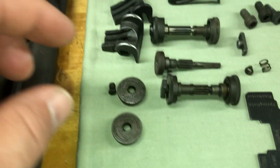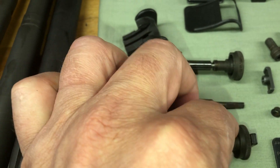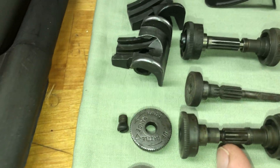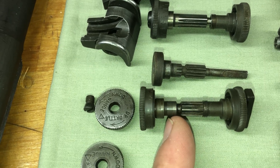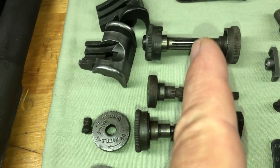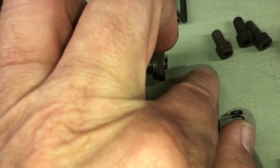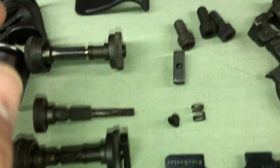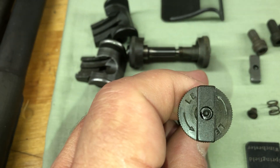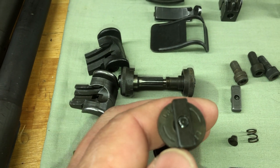The pinion itself - there are a few different types of pinions, and sometimes there are different threads on the ends. Some of them were cut in the middle right there, and some of them - the splines don't go through from the cut. There are ones without any cuts whatsoever. These are lock bars. This one's curved, so this is an earlier lock bar - the top is not a right angle. This is a later lock bar - it's straight across the top.